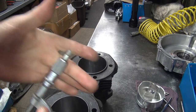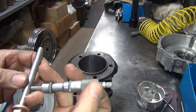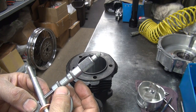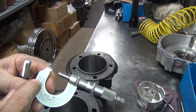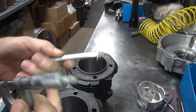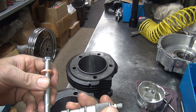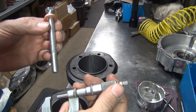That's how you read the mics, and you can go all the way up to whatever number you want. This here is a three-eighths bolt. Go ahead and spin it down until it hits it and you can read it. This one is three-fifty because it's got two full lines, and you add 19 to it — 50 and 19 is 69, so it's 369 thousandths. Now three-eighths is supposed to be .375, or 375 thousandths. So this is six thousandths undersized, which is normal — bolts are about five to six thousandths undersized on their shanks so they fit inside three-eighths holes nicely.